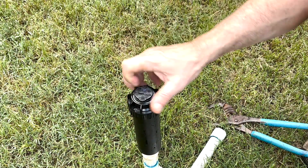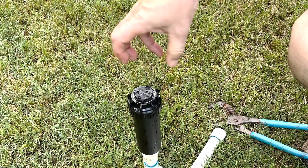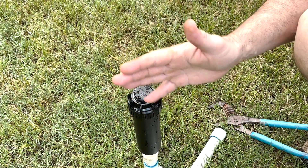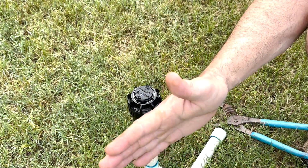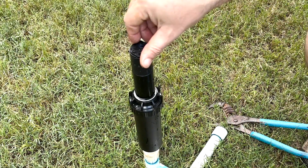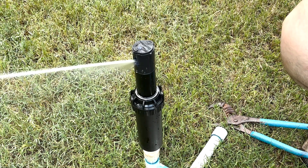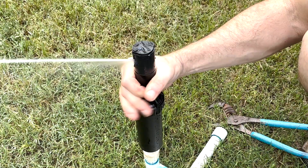Let's turn it on and make our fine-tune adjustments. We're going to set the left limit first by using the top part. While it's running, pretty much all rotors have a little adjustment room on top where you can fast-forward it. But make no mistake — when you swing it around, you're not going to see exactly where the limit is. So what I do is turn it about 75% of the way, let the gears catch, then look at exactly where it stops in its travel and make fine-tune adjustments based on that. When you hear it click and stop and change direction, you can grab the shaft and turn it whichever direction you need the left limit to go.